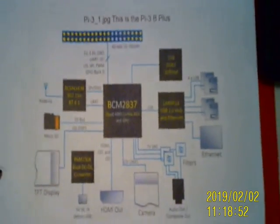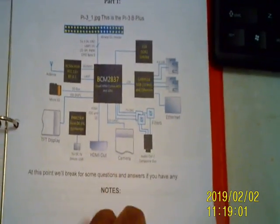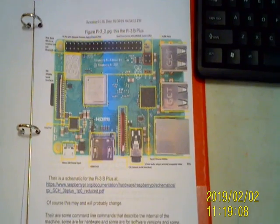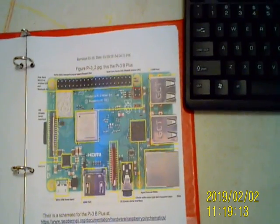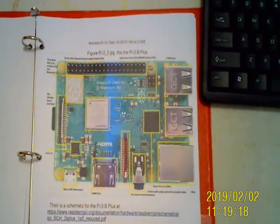And then there's a digital display interface. You can take a monitor from a computer and get a special module that you interface at that point and drive that monitor from the Raspberry Pi. I've been thinking about taking one of my old dead laptops, gutting everything, and putting a Raspberry Pi in it with one of these modules, and just using the display that's built inside the laptop.